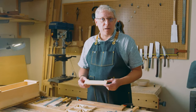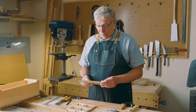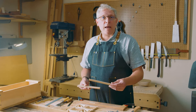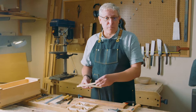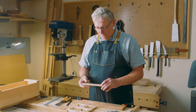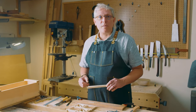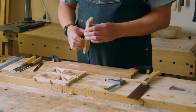Let me talk for a minute about the material I'm using today. I'm using basswood, which is admittedly not a Japanese wood, but as far as woods we have in North America, it's a really good choice for this kind of work. It's light in color with a very indistinct grain, so the grain pattern doesn't detract from the overall design. It's also moderately hard and moderately soft, so it has just enough compression that when we press-fit these joints together, the wood itself helps hold things together.